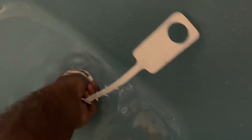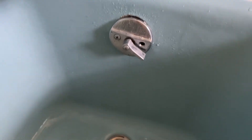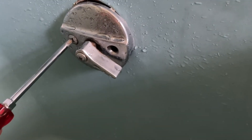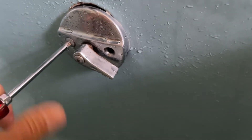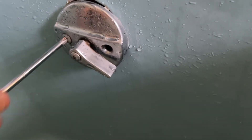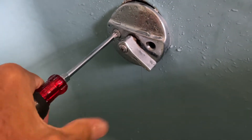As you can see, I was shoving this thing in there trying to see if I could clear the hair that way, but that didn't work. So I ended up having to pull that whole drain stop out. I'm going to show you how to pull it out, how to rehab it, how to clean it up, how to drill out some broken screws, and how to put that thing back on and have it working as good as new. If you notice, this plate is listing to the right — it's because one of the screws is already broken off, and that caused the hair catcher or the mechanism to drop lower into the outflow.